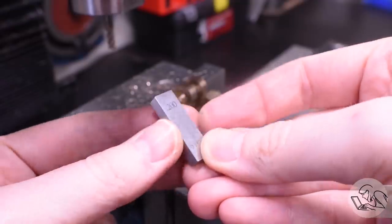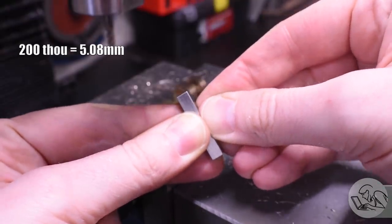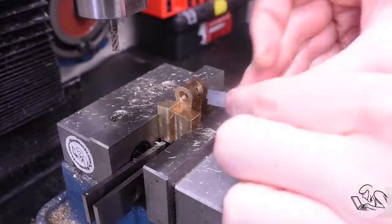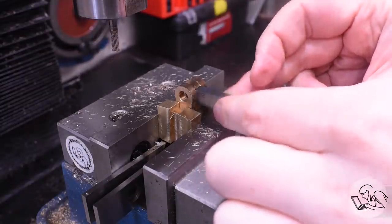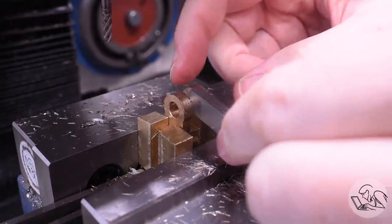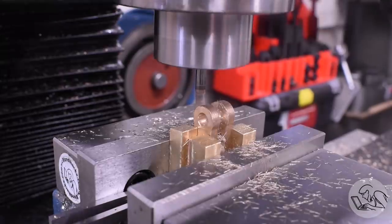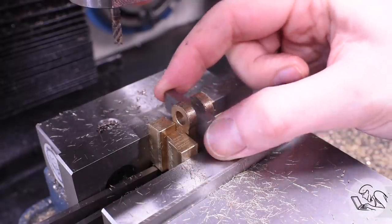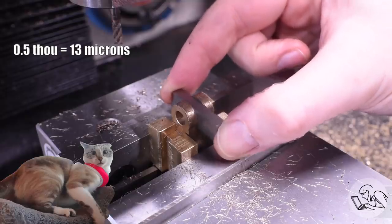For my final check I'll ring together a stack of 200 thou gauge blocks. The stack wants to start going in but it's a little snug - just doesn't quite want to go. A shorter stack confirms the slot is at 198. That would honestly be fine and well within tolerance, but I was in a fussy mood so I took another thou off each side. Now the 200 slides in there nice. It's actually a skitch loose so I think it's probably half thou oversized - but don't tell my supervisor.